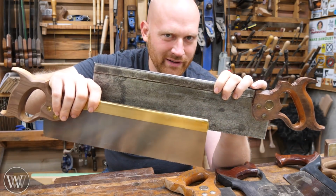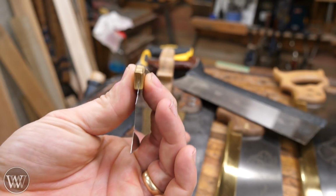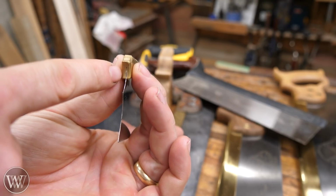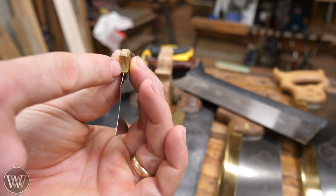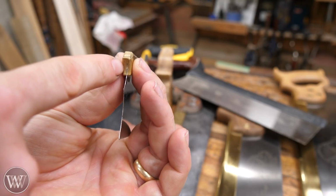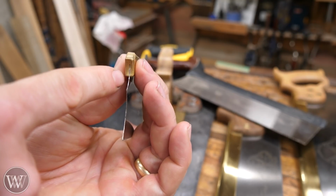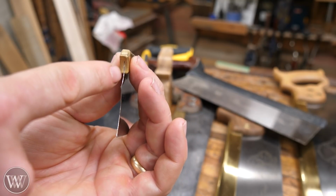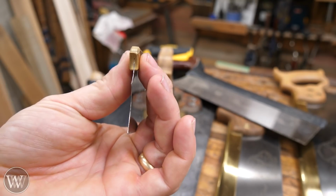The brass looks awesome. Now we can look at non-folded backs. You can see how this actually had a cut put into it, and that blade then fits into the cut. And usually either that cut is really, really tight and it's jammed up in there, or the back is then glued into place. This holds the blade far more stiffly, but if there's ever any kink or pressure in the blade, it will start causing problems. So usually a non-folded back is not quite as good.